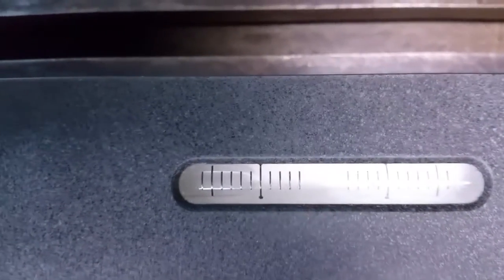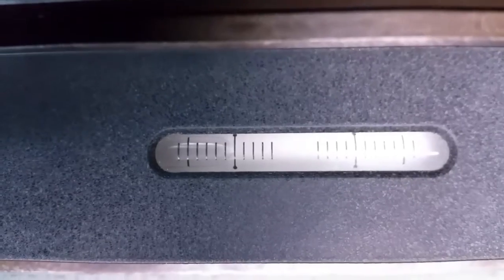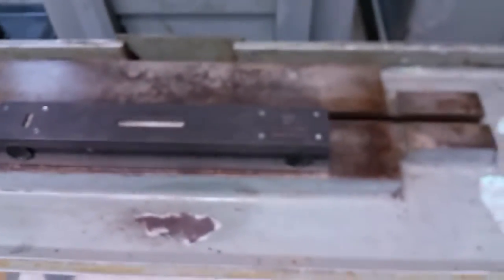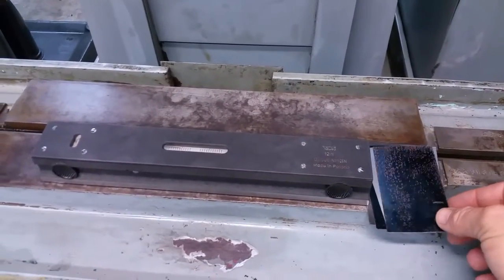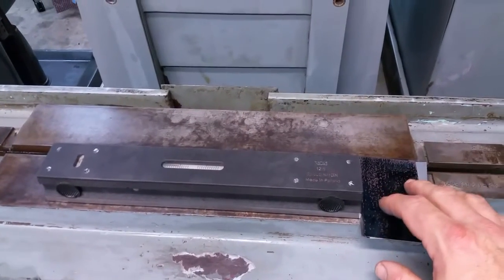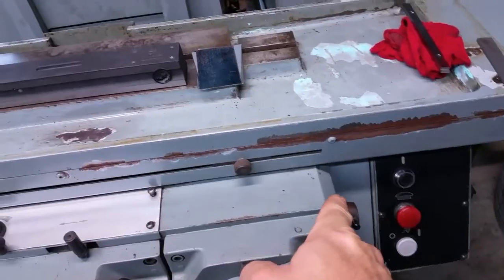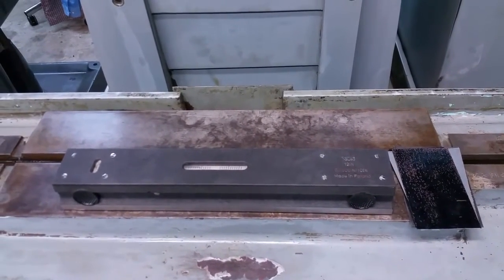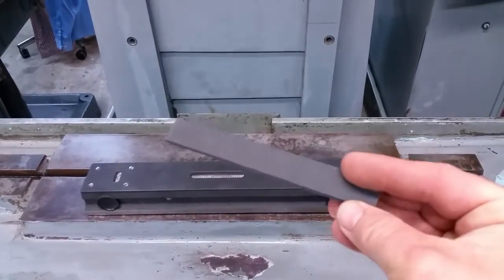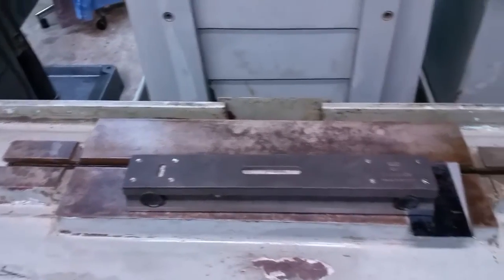We are very far off — we've got a long way to go. What I'm going to do is put some shims under this end. I've got a whole pile of them here. I've already tested it off camera so I know the future. I'll put those under there, and presumably if I put these under this foot over here it should come out level longitudinally. Now I did stone the table and cleaned it pretty good with WD-40. It's in very good condition so the table isn't affecting anything too much right now.